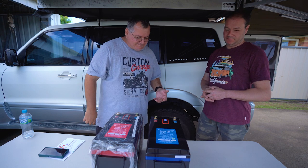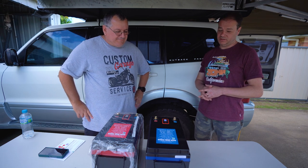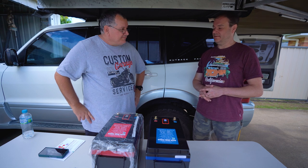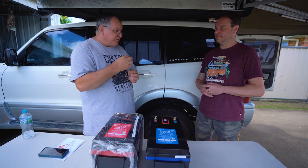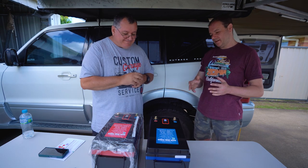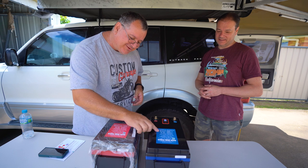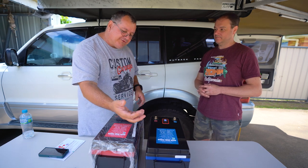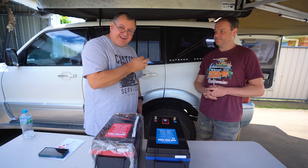Once you run two in parallel, does that mean you'll get 500 amps continuous? Technically yes. The active balancer keeps the battery cells balanced all the time. The newer versions trigger balancing at about 3.4 volts, which is a little better overall. That requires a little more setting up on our end, but from the customer's end you don't do anything. For charging, you want 14.4 volts for your bulk charge and 13.8 volts for your float charge. That can vary a little — 14.4 is the magic number. Maximum is 14.6 volts at 150 amps at 50 degrees Celsius. Discharge minimum is 10.4 volts.